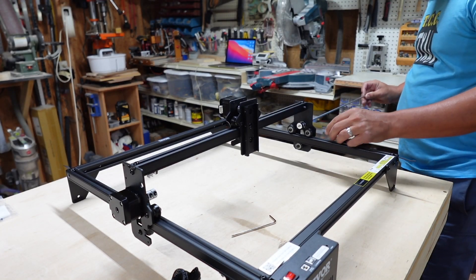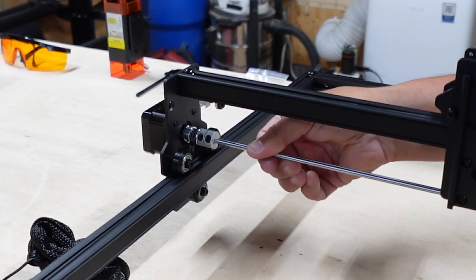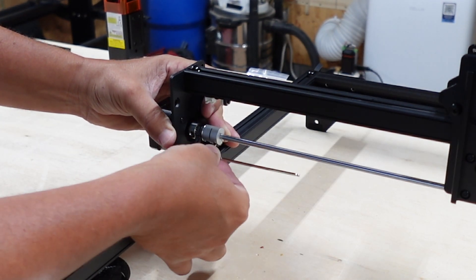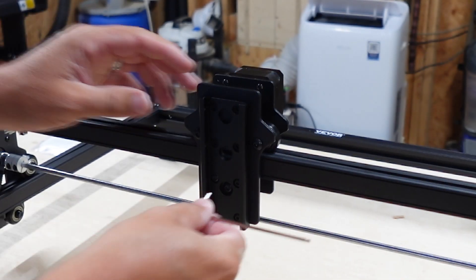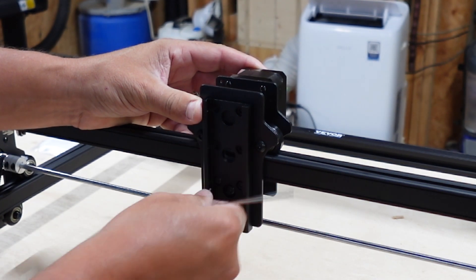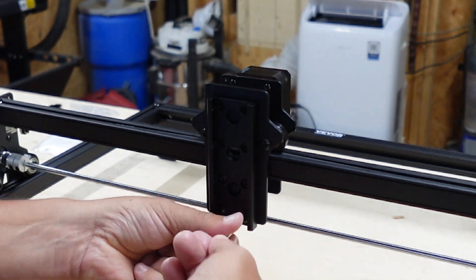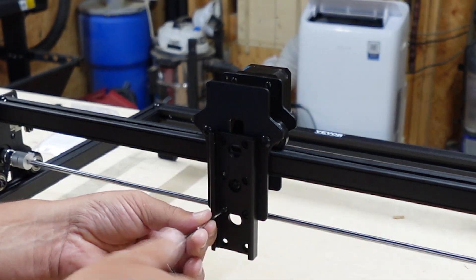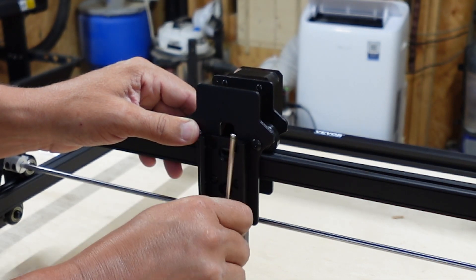You can see right here I'm actually installing a drive screw that controls both belts at the same time. That inserts into that hole. I'm tightening an allen key — and don't forget, there is another allen key on both sides that you have to tighten down, so don't miss that. Right here I'm lowering a clamp down one notch so that the laser is a little bit lower to the surface of the material you're using.